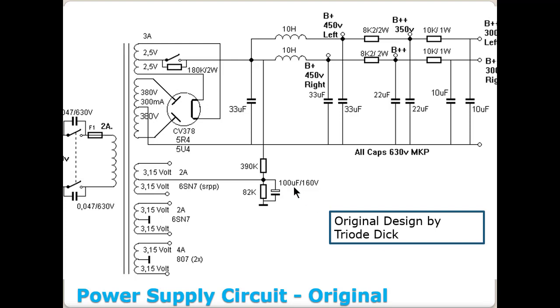You could think of it that way. And then this little filter cap here just helps smooth that a little bit. But really what they're doing is floating this 6.3 volts up off of ground, off of 0 volts. And that's very much needed for this RPP stage right here. It helps with noise rejection, kind of gets off the noise floor, etc. But my point is, it would not hurt if you did that on all of the 6.3 volt windings